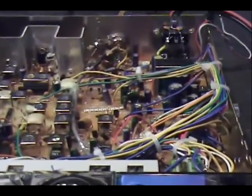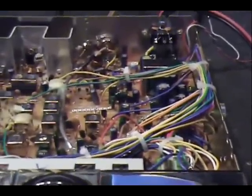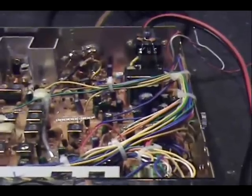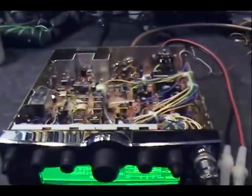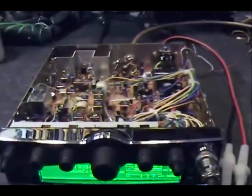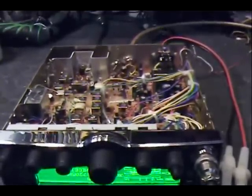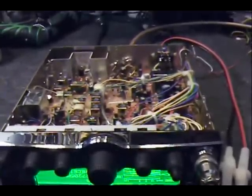There you have it folks. We covered the basic features of the radio, wattage out of the box, wattage with a standard peak and tune, disabling the modulation limiter versus just turning it up from the pot, scope patterns, receive alignment, and frequency. It's not as glamorous as the RFX but gives you an idea of what you've got with the basic unit. If you need one of these radios, find me at customCBradios.com. This is CB Repairman — so long until the next video.